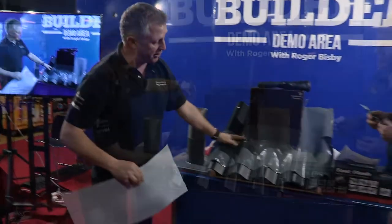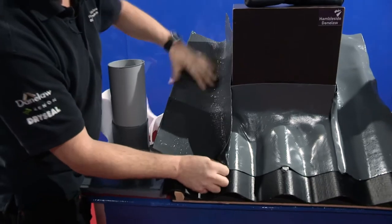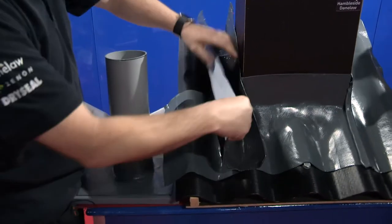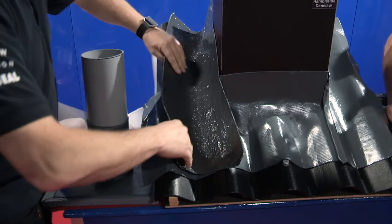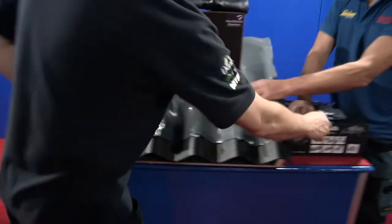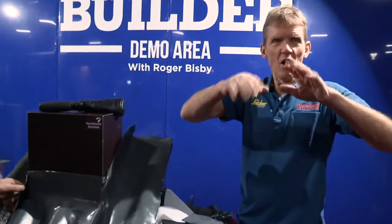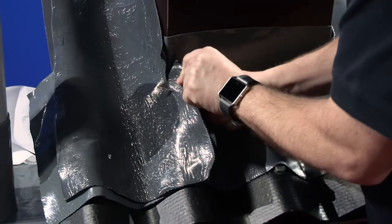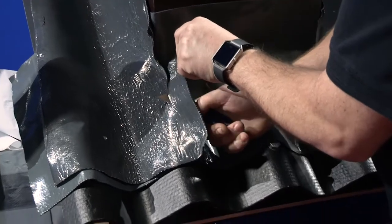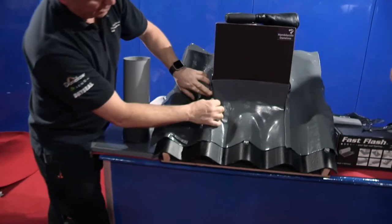Another way of cutting it around the corner — get it into place down the side. Dress it down. That's my favourite way of doing it. Because it's belt and braces: it's folded, welted, stuck down. What we're going to do is cut it down again — you only need about a centimetre. Slice it straight down. Just work it nicely around the corner.